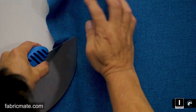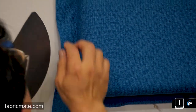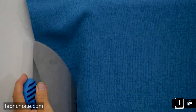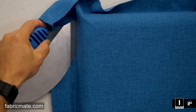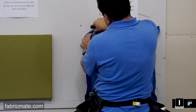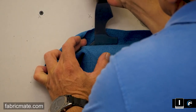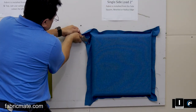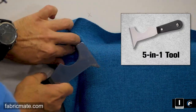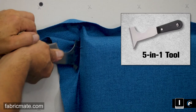Make sure that there's no soiling occurring, and maybe check for a flaw in the fabric that does occur from time to time. It's really your chance to stand back on these large panels. We've had occasions where people have put the fabric on backwards or in reversed orientation, and it really does show once it's already stuck in. You're going to be seeing little different peaks here behind the installer going into the hidden channel on the back.